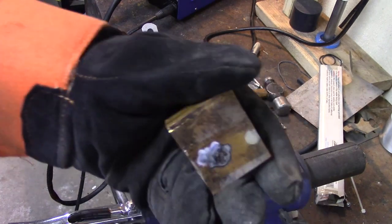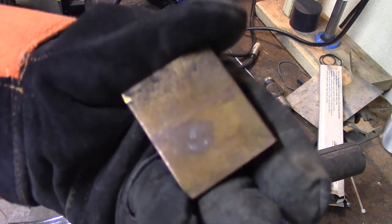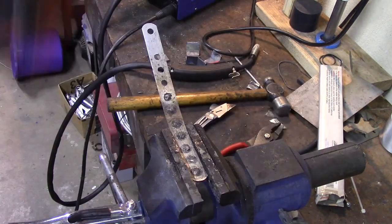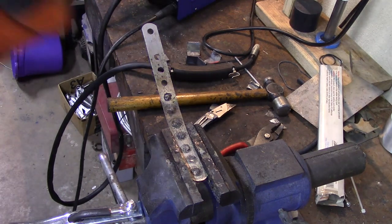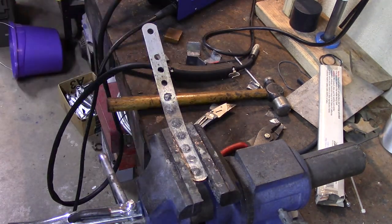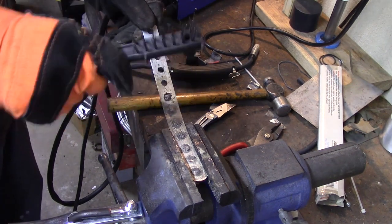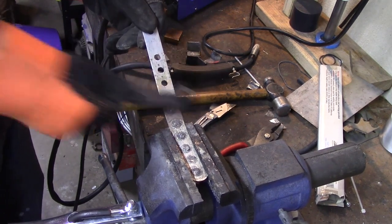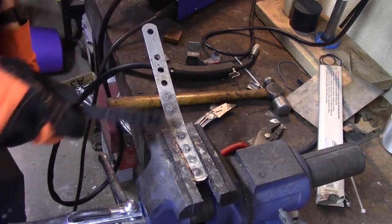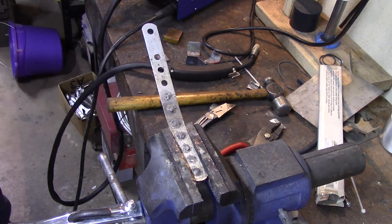Nothing really sticks to the copper block. You can take your wire brush and brush it, and other than some discoloring, it looks as good as it did when it started. And they actually make these for welders that have handles on them, in different sizes and different shapes, triangular ones with handles, and it makes the gap filling and hole filling a lot easier. So yeah, you can see how much better that was. It's a lot quicker and a lot less to grind off.